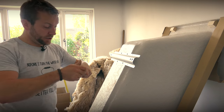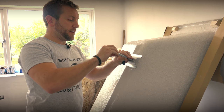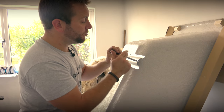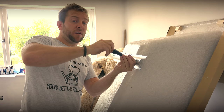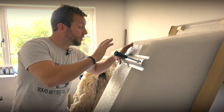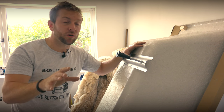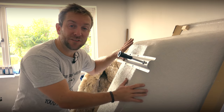What you want to do now is just make up one of your feet — I'll have these just on the inside like so. Every bath manufacturer is different; this is just the way I do it. Try to have your feet quite high up because what we're going to do is batten our wall. The idea is once we've got our wall battens on, we use the height of the side panel and where the tiles are to define how high we want to make the bath later in the job. I'm going to put on my other feet, get the block pot on at the bottom, and also pop the waste on if we've got one on site.